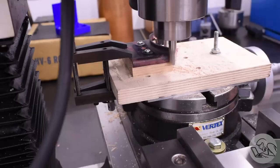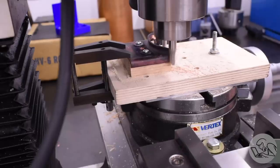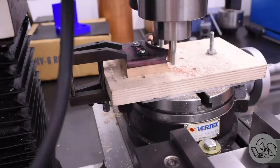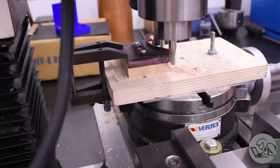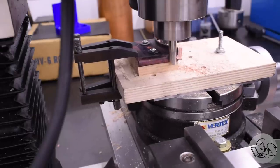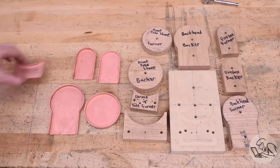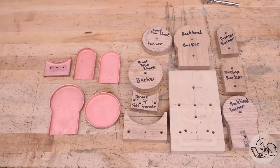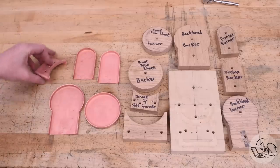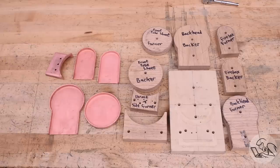And then finally, I machined the sides of the throat to dimension. Kozo suggests sawing and filing this flat on the sides, but I figured I've got it in this setup here, so it's easy enough to just machine that until the side is parallel with the hammer-formed side there. Then everything went in the pickle bath to get rid of all the annealing crud, make it all shiny once again. Well, at least make it clean anyway. Copper comes out pink from the pickling acid, but it'll turn back to a normal copper color over time.